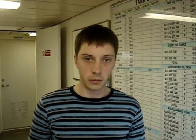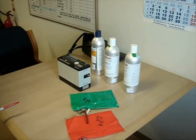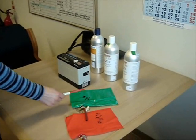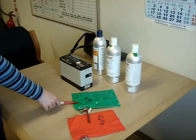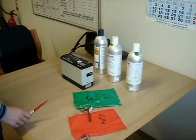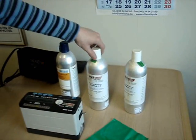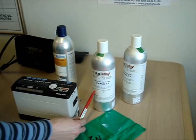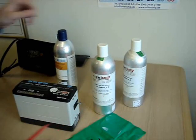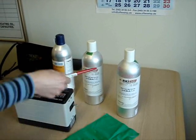Span gas calibration of the portable gas measuring device RX415 requires special equipment: two portable bags for gas. The green one is used for nitrogen and the red one is used for isobutane. We will need three types of span gases. One is 0.9% or 0.7% by volume of isobutane with the balance being synthetic air. This one is used to calibrate the lower explosive limit on the device.